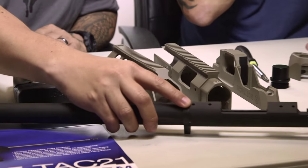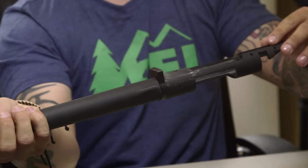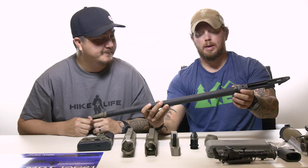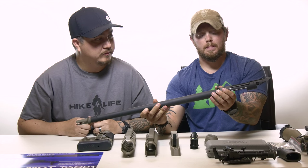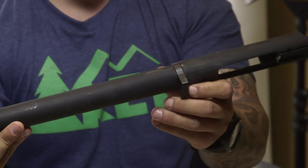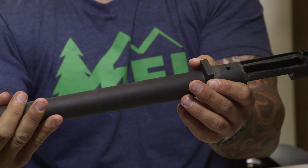What we're going to do is show you how to actually put all the pieces together. They say it's about a half-hour build — we're going to see if we can do it a little bit faster. We've already taken the barrel out of the previous rifle. We had to remove the trigger from the action. When this rifle was built by Spartan Rifles out of San Jose, we used a Badger Ordnance recoil lug. What you need to know about the MDT system is that you must use a standard Remington 700 shaped recoil lug — we ordered the 0.318 thickness from MDT for the rigidity we're looking for, but we need this specific pattern for it to work in this chassis.